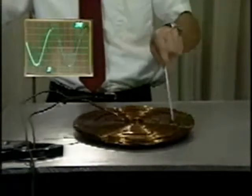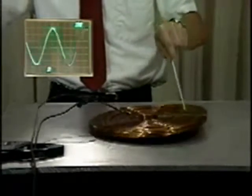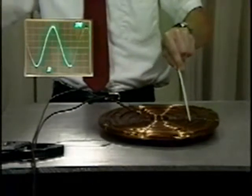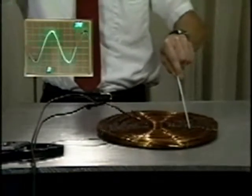When the RMS current is large enough that the Lorentz force can overcome the coil weight, the coil lifts off the ground plane. Increasing the current further results in an increase in the levitation force at a given altitude, so the coil rises to make the upward magnetic force equal to that of the coil weight.